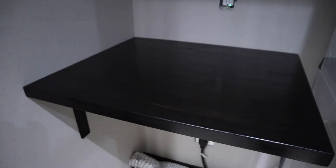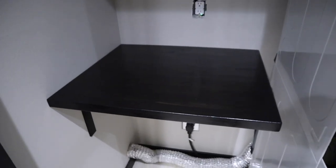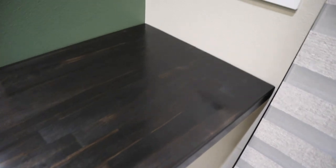I am checking in from the condo and I'm excited to show you that my butcher block countertops are in the process of being installed. Here is the first one in the laundry closet. My dad actually made the custom brackets to mount these and we weren't sure how exactly they were going to work out, if they would be stable enough on their own. This one is actually pretty good, it just has a little bit of rock in the corner which we're going to secure with an angle bracket. Here in the kitchen, this one is in but it still needs a little bit more work. My dad also made a custom angle bracket to secure it in this wall, but there is just a little bit of gap over here and we weren't going to get quite the secure connection to the butcher block that we were hoping for, so he's going to make an improved bracket to alleviate the little bit of issue we have here.